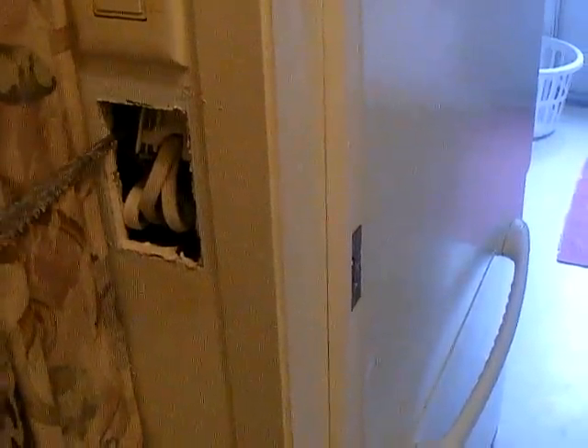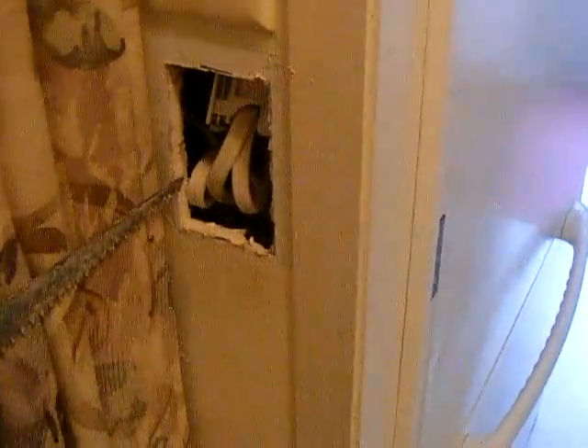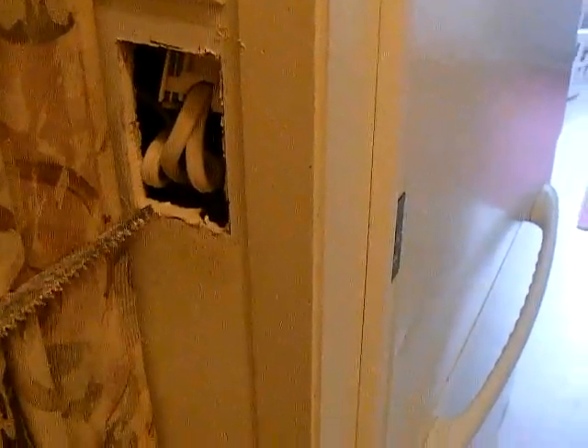What I've done is I've stabbed in here and cut along, and I was very careful to hold this wire out of the way with my fingers so that I didn't cut it. Everything's live — the lights are on, I'm doing this live. Then I pushed it out of the way with my fingers again and cut very carefully and slowly in here, then followed up the stud.